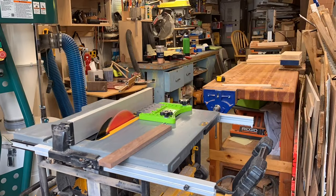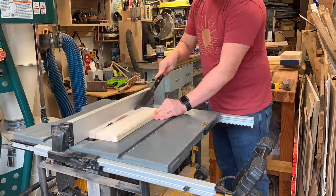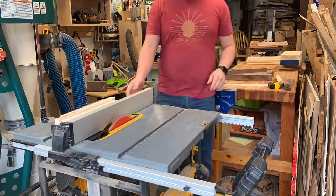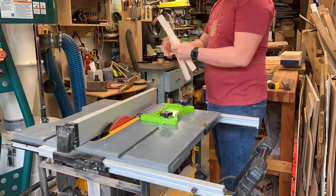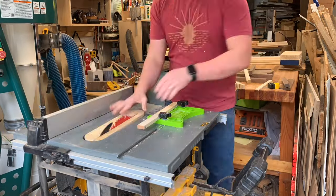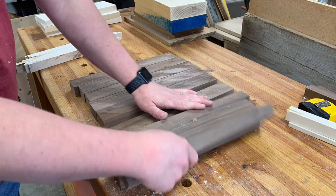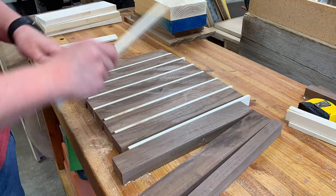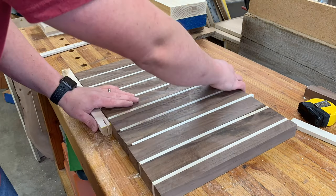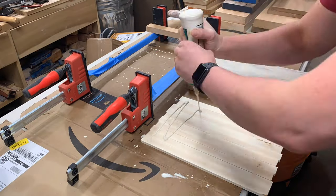Start ripping the pieces down — I went with black walnut and maple, plus several other species for this batch. You're just ripping it down for that first glue-up, which is more of an edge grain glue-up. One recommendation: have one of the pieces half the thickness of the rest. On the far right you can see that thinner piece of walnut — that'll be really helpful for the second glue-up.